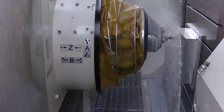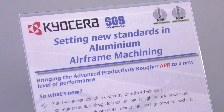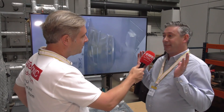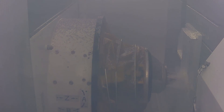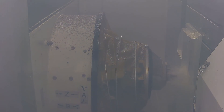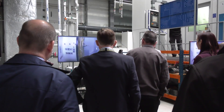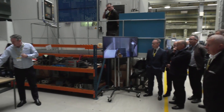So Ray, how's Kyocera SGS helping improve airframe machining efficiency? At today's event what we've been showcasing is our latest APR3 and APR4, which is a roughing tool — 3-flute and 4-flute — and we're showing what we can do with metal removal on the latest high-speed machines. We're running under this 130 kilowatt machine here and we're pulling up to 12 litres a minute roughing, and we can show that we're pulling less load on the tool, less spikes, and a much quieter cut.